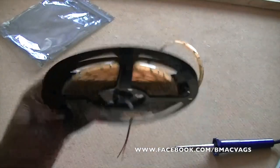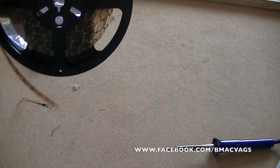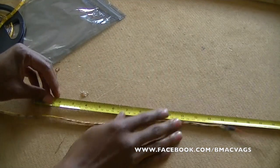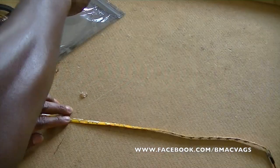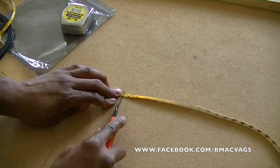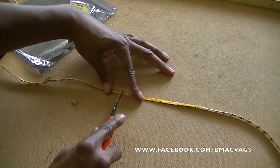First, you're going to need to buy these LED strips, which will be available on my website. You can buy them already pre-cut or you can get them in a row like this. We've got them in a row because we're going to do a few more projects using it. Next thing you've got to do is look for a cutting point - you're going to see two dots on it, which are the places you can cut it. We used a 35 centimetre length for this modification, and you cut it at the location point. It's probably easier to use scissors more so than a Stanley blade, but whatever works, works.